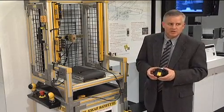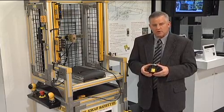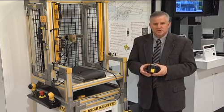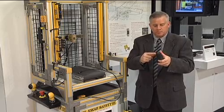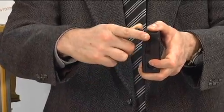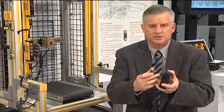The mechanical safety interlock switch we're going to talk about today is the least safe of all these, although it's the most popular on the market today. It is the oldest technology, which involves a key that is inserted into the switch. The problem with this key is it's typically misaligned after time when the mounting elements that it's attached to in doors and portals sag and become misaligned.